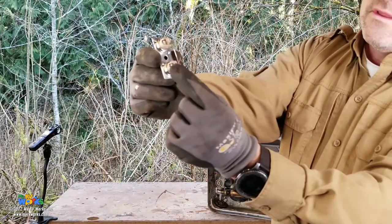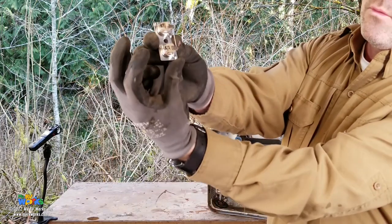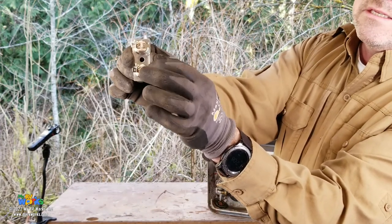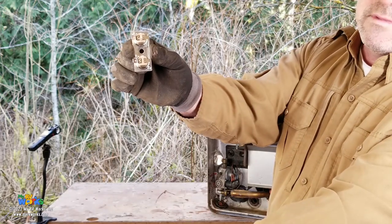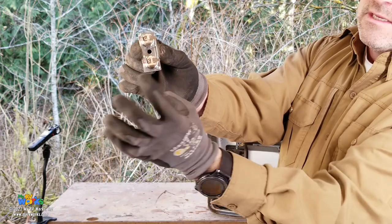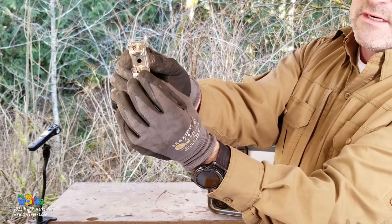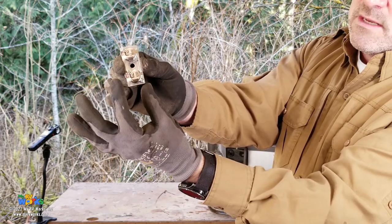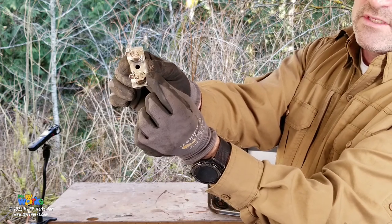Okay? So this bottom circuit, so I'm going to connect a wire to this point and this point. Both of these thermostats need to be closed in order for me to send power over to my fuel solenoid. Okay, so I come in here. This one is set to 140 degrees. So if I'm less than 140 degrees, it's closed. As soon as I get to 140, it opens. Therefore, my circuit is open. But if I'm less than 140 degrees, I'm going to pass my 12 volts through to the other side.